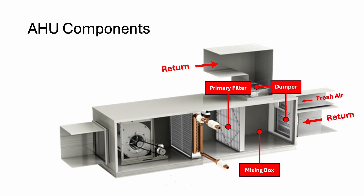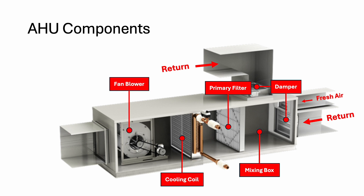After the primary filter, we come to the cooling coil. As mentioned, it either uses refrigerant or chilled water. After the cooling coil, we have the fan section. There are two sections — one is the fan blower, meaning the blade that rotates, and the other is the fan motor. Sometimes you can see the belt here, so this is called a belt-driven fan motor. Or sometimes they use direct drive or a plug fan, which is more efficient. After the fan blower, the air is supplied either horizontally or from the top, depending on the orientation and layout.